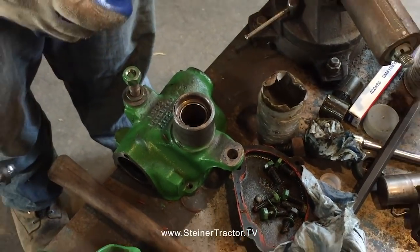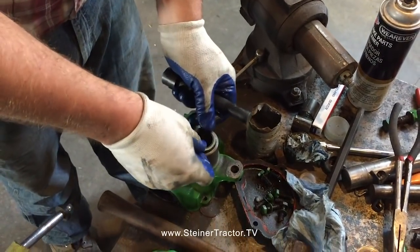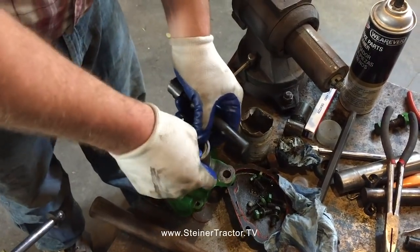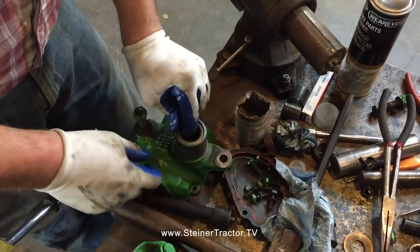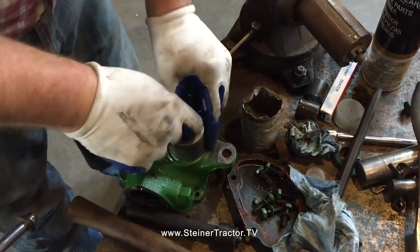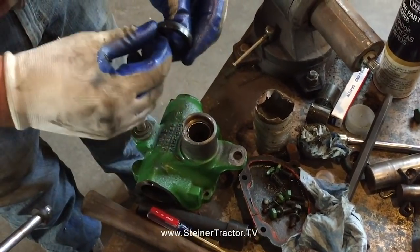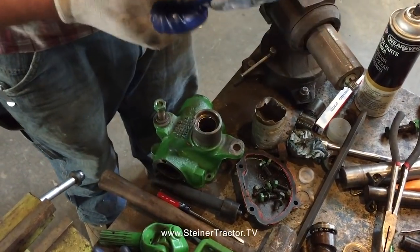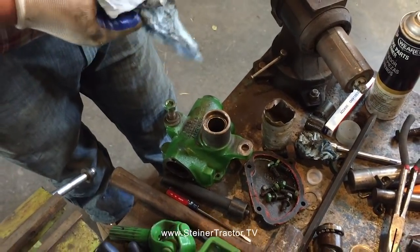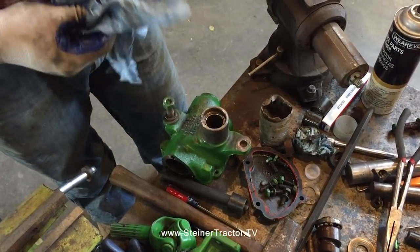And here's our grease seal. It's important to install our seal with the lip facing the oil to keep everything in. That may have been why the silicone was on it, since I could just push that seal into place. That would be why the silicone was on. In this case, we may have to use some sort of a sealer to promote the seal staying in place. Not that it can go anywhere, but you sure don't want it coming loose over time.